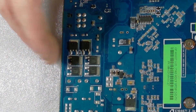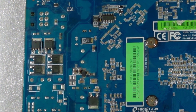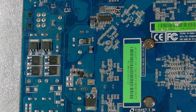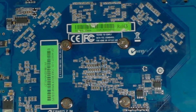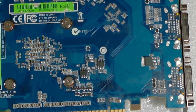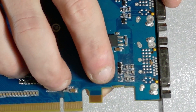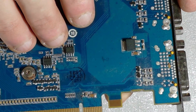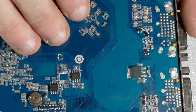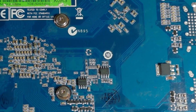We'll flip it around and take a close-up look here. There isn't a whole lot to go over without actually taking it fully apart. From the green stickers on it, I've noticed it must have been through another company — some sort of refurbisher. This graphics card does need work. I need to figure out the schematics for it because right here it has some damage — we're missing a MOSFET. Kind of sucks. I'm not sure which ones they are; it could be a 3.3 volt, most likely.